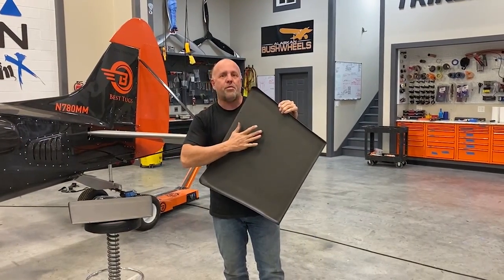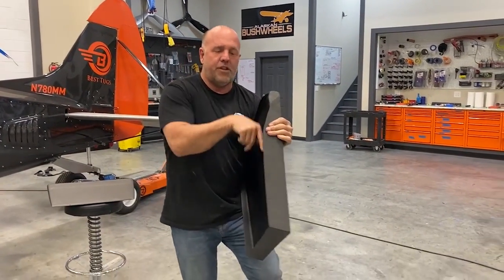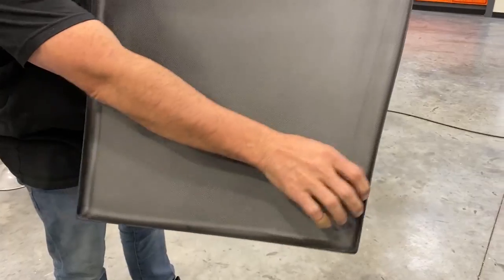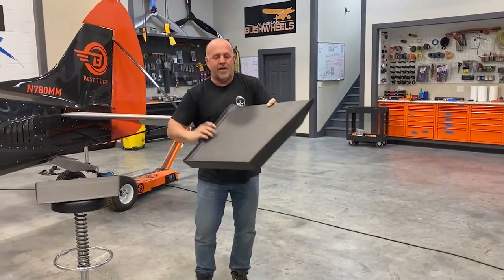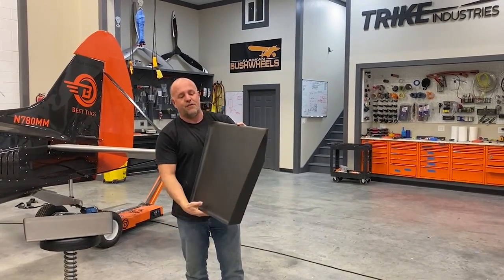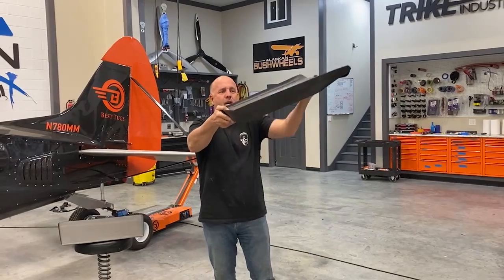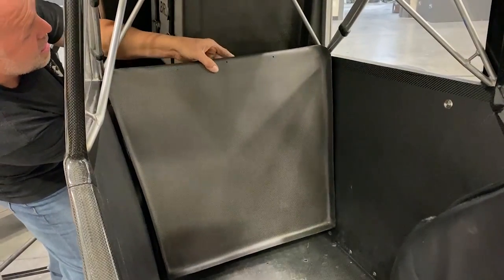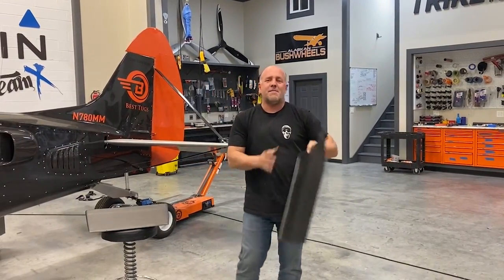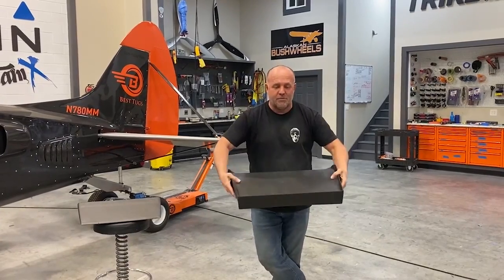This is a quarter-inch honeycomb with multiple layers of carbon fiber, and I turned it into a beam by adding these edges — both directions, extremely thick. You can see this big rounded edge, thick carbon, double-sided, and then this bolts in. It attaches not only to the mainframe bar in the back, but also the steel frame in the floor. The way you put it in is real simple and fast. It's got this perfect radius — it hooks on the back bar, folds down and snaps into place, then bolts into the steel frame. And then the back seat goes in. It's going to make a really comfortable, really wide seat that's locked in place, and it turned out really, really lightweight.